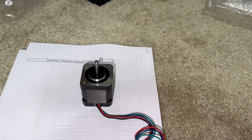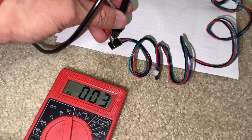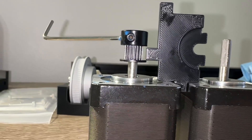For the Z drive motors, I like to first test the wires for continuity — that way we don't do all this work just to find out that the motor is a dud at the end. Using the jig, make sure the 16-tooth pulley is at the proper height and screw it down.